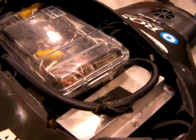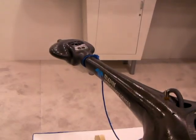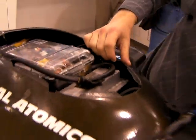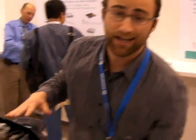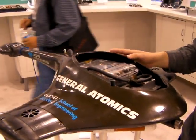As far as the propulsion system goes, we have three vertical thrusters on the wings and on the tail. These control the pitch, roll, and depth. Underneath we have the Voith-Schneider propellers. The way these work is they spin around and generate a force vector, but if you change the position up here, the pitch of the blade moves around, giving you a full force vector in the lateral plane. So the vehicle can actually strafe as well as turn, giving you yaw and propulsion.